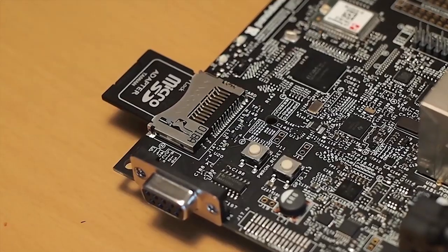We faced two challenges with respect to the Panda board. One was the installation of the operating system by making the SD card bootable. The second was the UART communication — once the data was transferred, we did not receive all of it. We were missing some data and the received data was found to be erroneous. We solved this problem by sending a parity bit along with the data bits and the stop bit.